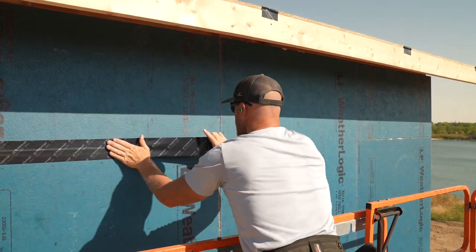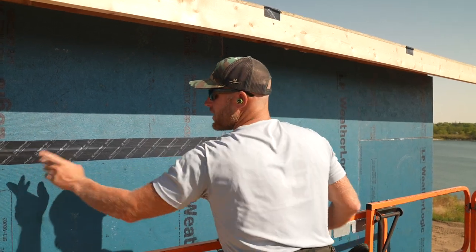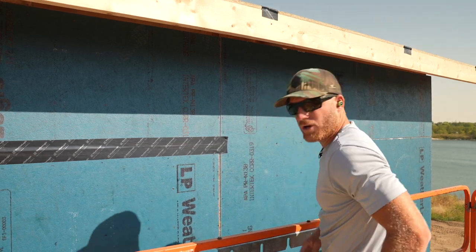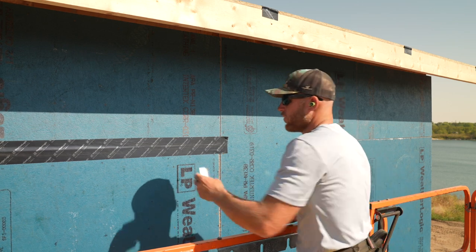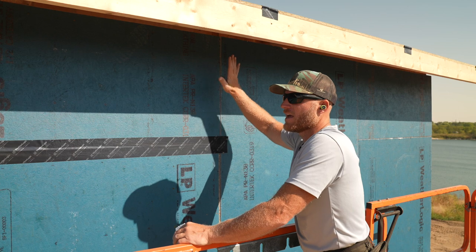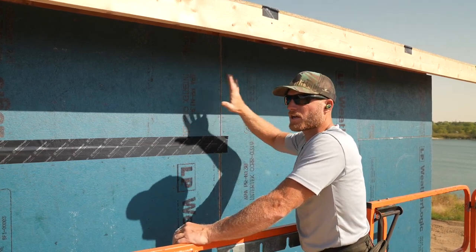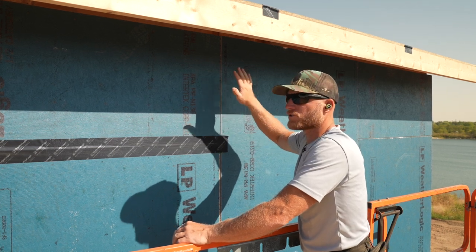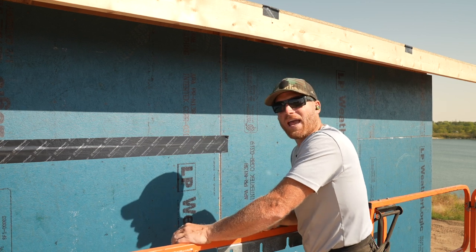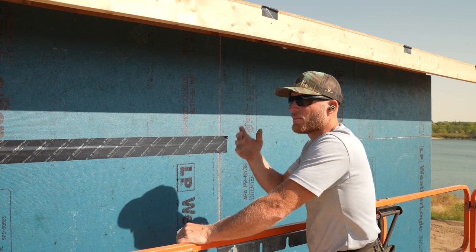Now, this joint right here actually is where a window is, so there's nothing here. In this instance, I'm gonna be waiting on my windows for quite some time. Could be a couple months, most likely will be a couple months, could be a few months. By doing this, I can have an airtight, water-resistant barrier to my building so work can continue on the inside. I can have all the structure I need, and when the windows come in, I'm gonna cut my holes out and I'm gonna install those and keep going without having to mess with house wrap,